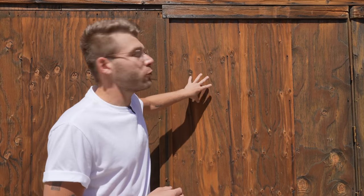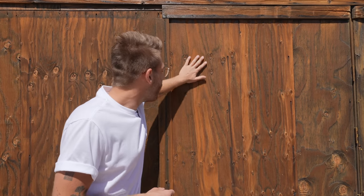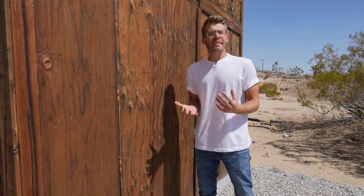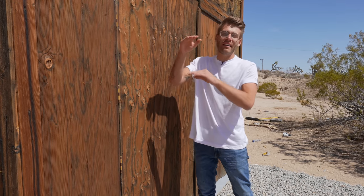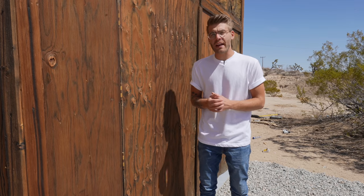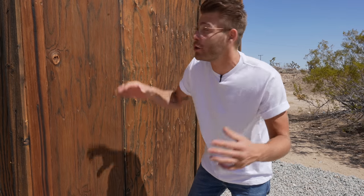The third quality I'd highlight is the general feel of the wood now. Before, this was really splintery with a lot of fuzzies on it, but now all of that is locked in and you can run your hand across it without getting pricked by anything. As I was spraying, especially on the second coat, you could see lines on the top and bottom of my spray pattern — that's called striping or tailing. In hindsight, I should have turned the pump up on my sprayer and that would have fixed my problem. Thankfully, all of that striping and tailing blended out when the second coat cured. It's a great learning experience before I go spraying the interior and exterior of the new house.